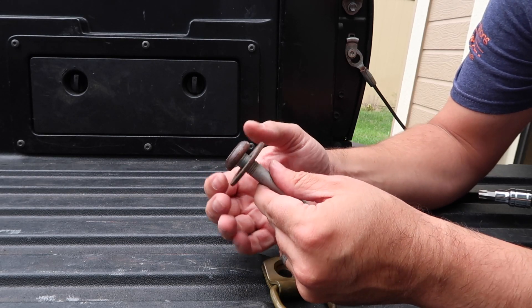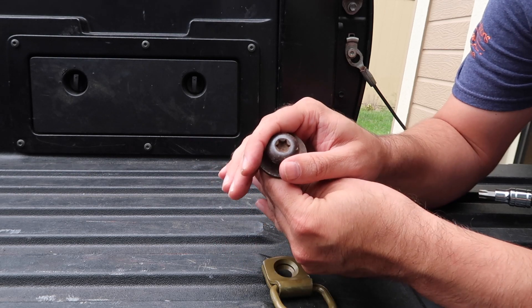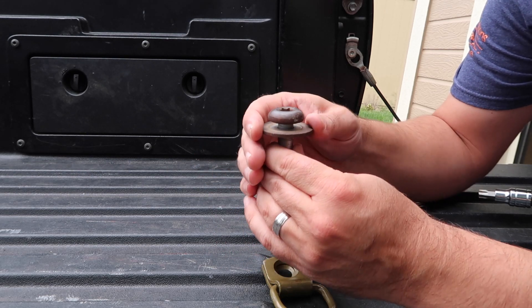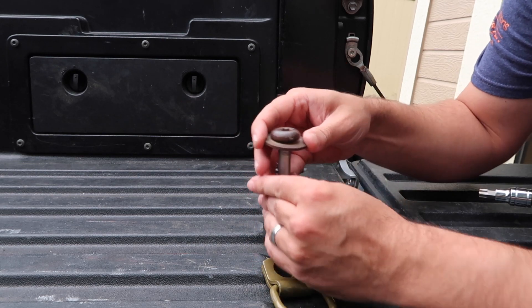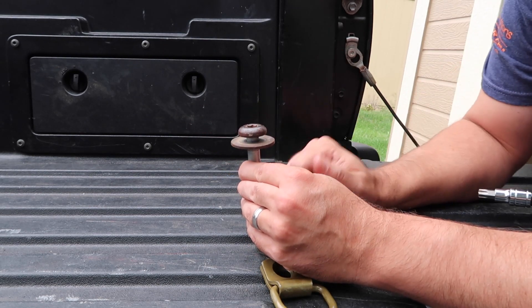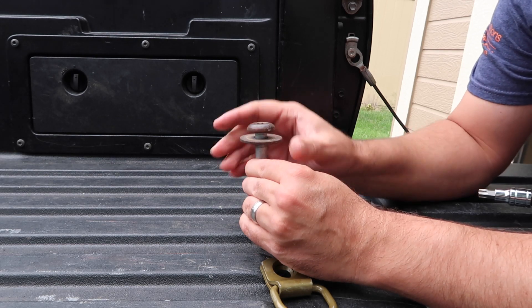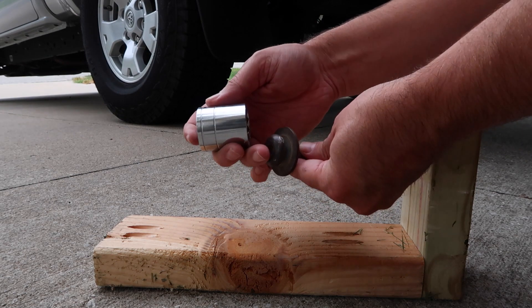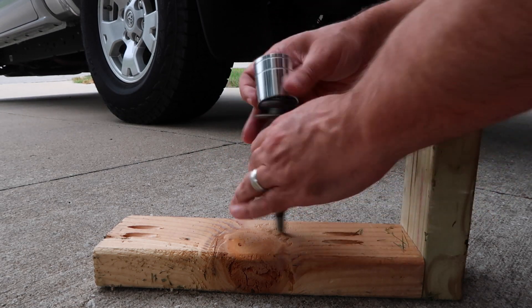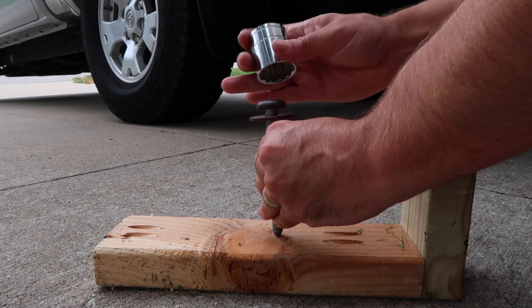What I'll probably do is put the washer underneath this. So I need to remove the washer from the bolt head — I'll need to get a socket that's big enough to go over the head. Since there are no threads down here we'll be good to pound it. I'm going to take a socket that's bigger than the head and pound it down just a little bit — it just has to go over this threshold here, not a big deal.